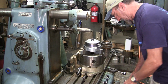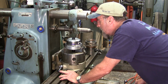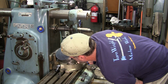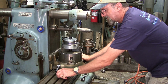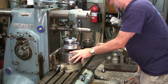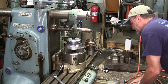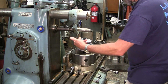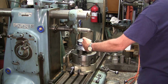Okay, let's go ahead and fire this on up. Let's bring in the carriage here a little bit. Yeah, I think we'll use those middle grooves right there, same thing as we did on the Bridgeport. We're just using the ways itself to align the head. Okay, now we know we're going to be cutting in that direction, and this head needs to be rotated around, so we'll bring that around here. Now we'll be coming in on this side.